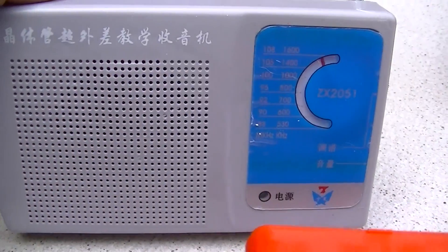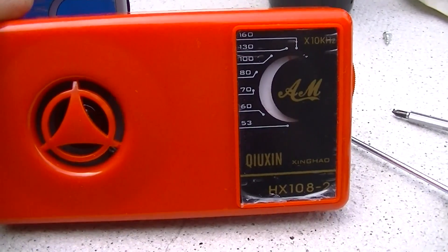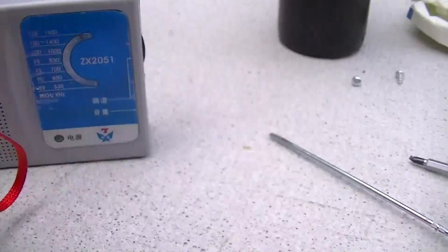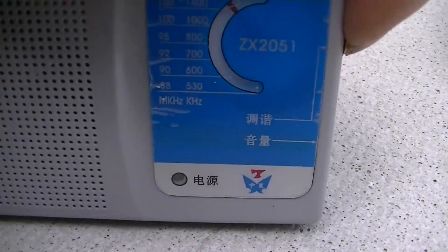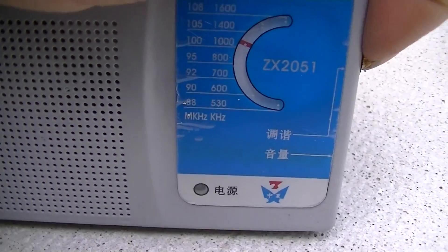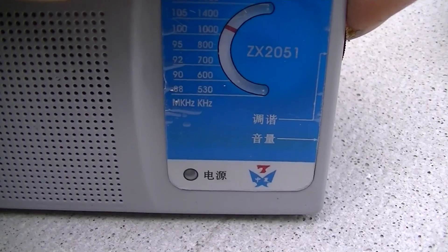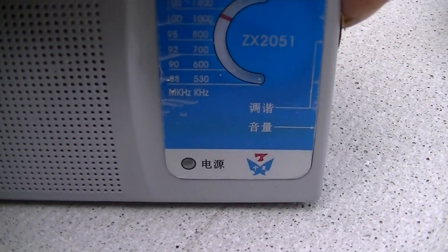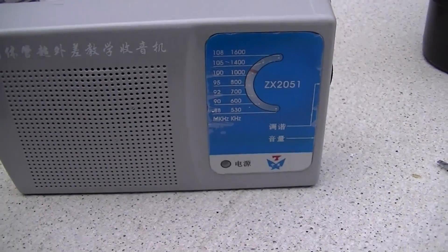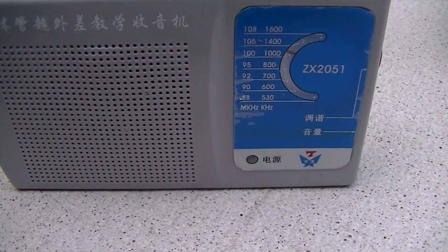FM works decent, but if you want a good AM kit radio, this one definitely doesn't have good selectivity — KNX is spread all across the band, as you can hear. This one has no selectivity at all. Everything is smeared all over everywhere.